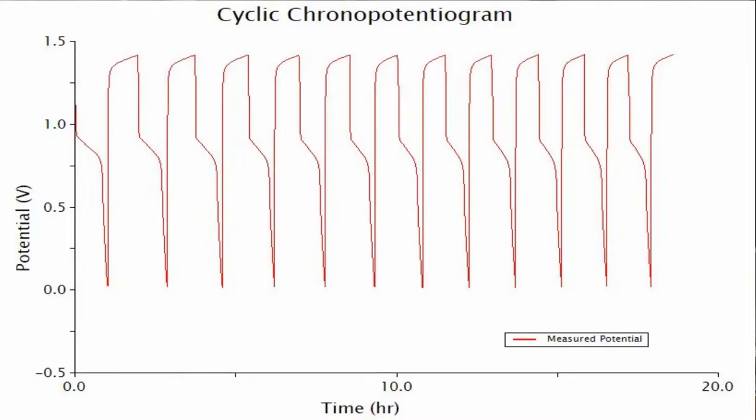So far we have had some success. We've developed an agar separator, we've tried a nafion separator, we've made batteries, and they've worked reasonably well. The best performer so far has been an agar separator, iron metal anode, and iron sulfate cathode. The problem with iron sulfate is that you just can't get very much into water — it is not very soluble, so at saturating conditions the energy density is still something like 1/200th of a commercial lithium-ion battery.